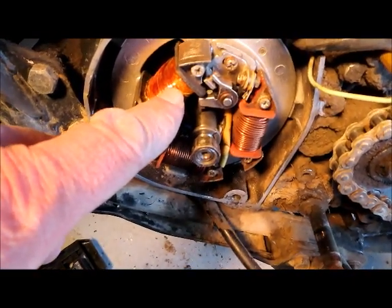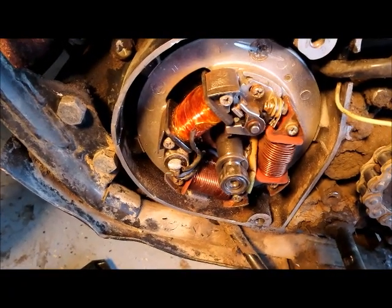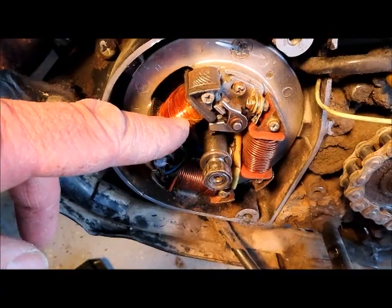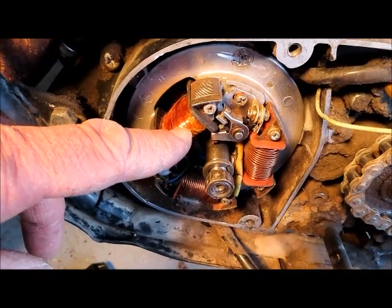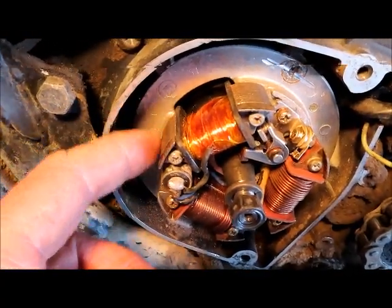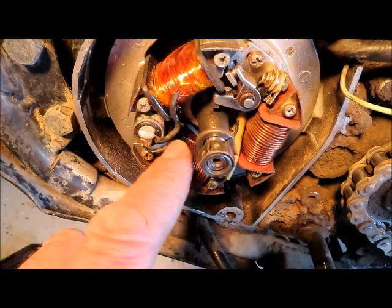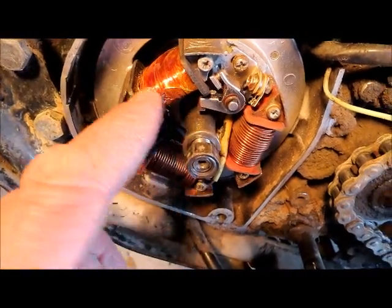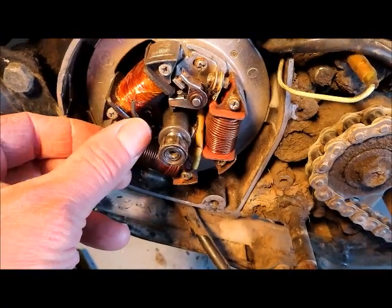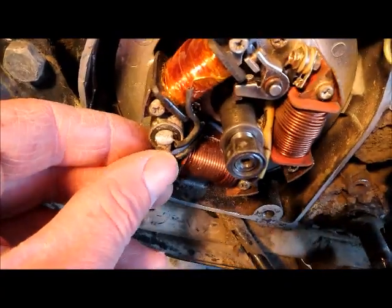You can't solder enameled wire without sanding it — you have to sand the area you're going to solder very well until you get down to base copper. You have to get all that enamel off. I soldered the grounding lug, which is bolted back here, and cleaned it really well — everything back there is pristine. I soldered this end and put a little piece of shrink wrap on. Before I put it all back together, I'm going to put some RTV on here to stabilize the wire from vibration.